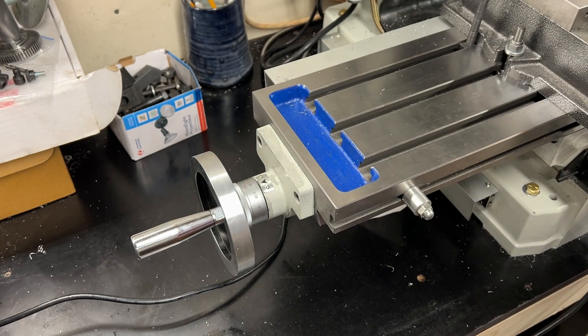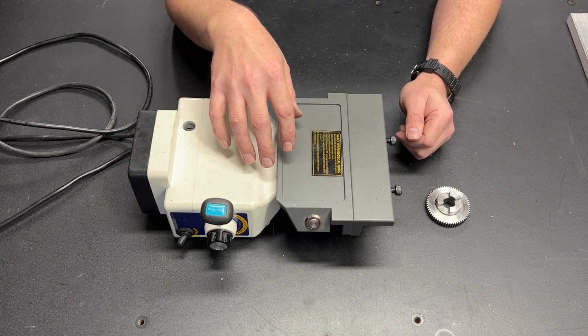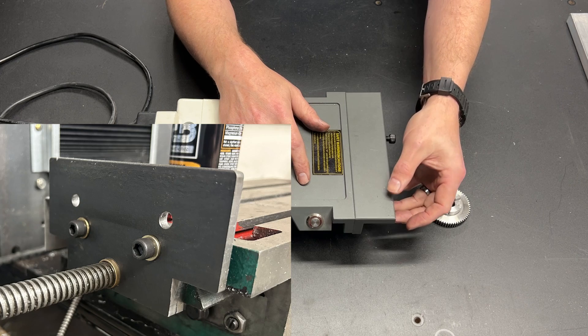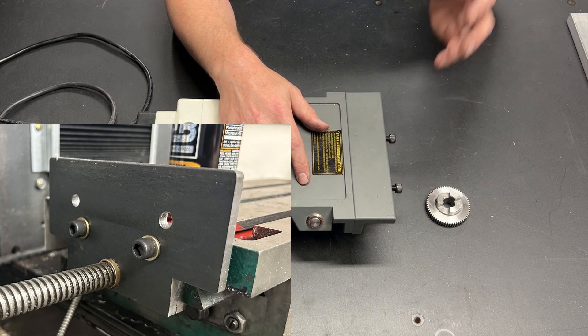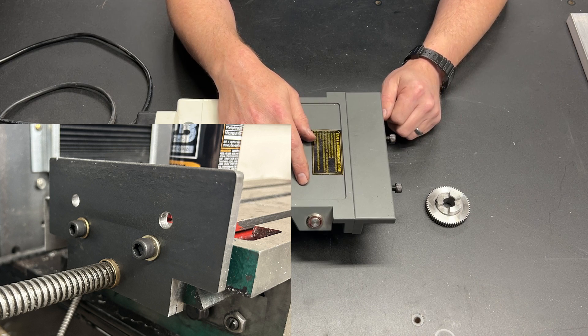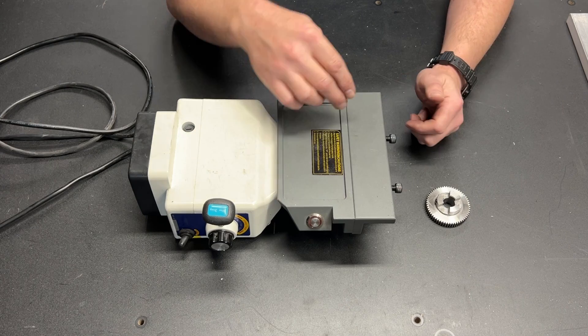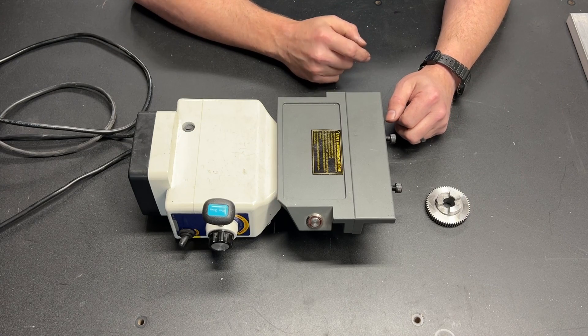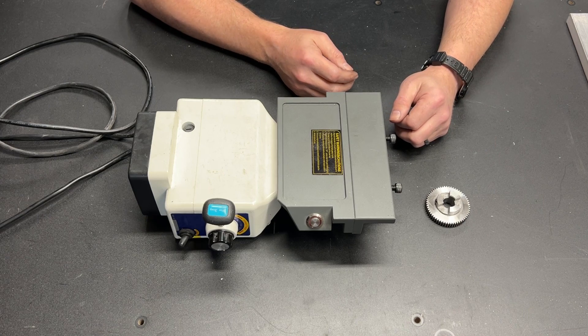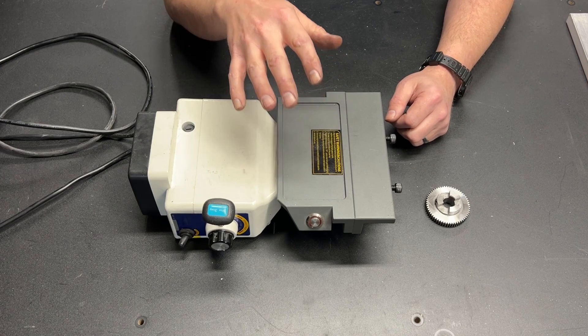So that's why we're going to ditch this bracket and go with a one-size-fits-one option. When I installed this on my DIY mill, I fabricated a bracket that bolted to the side of the cross-feed table, eliminating this janky hold-it-in-with-pressure setup. I don't know who thought this one-size-fits-none idea was a good idea. I understand why they did it — they wanted it to fit a variety of machines — but if you've got some machining skills, why not make it a solid mount?